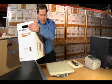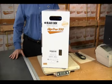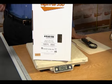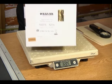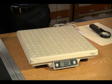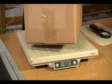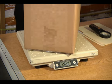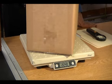Copper-clad aluminum conductors weigh a lot less than 100% annealed copper like we have with our Black Box cable. Let's take a box of our Cat6 cable and put it on a scale. Cat6 cable should weigh between 27 and 30 pounds. We bought our competitors' cable off one of those cheap cable websites, and as you notice, this cable only weighs in at about 22 pounds.